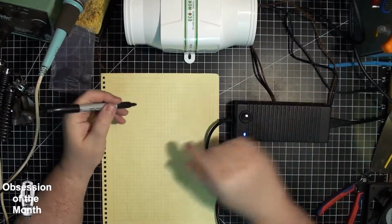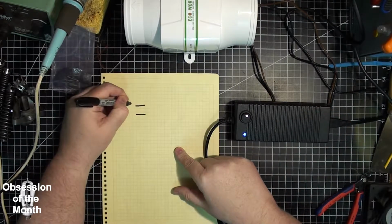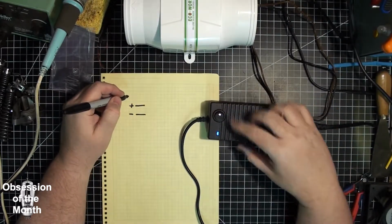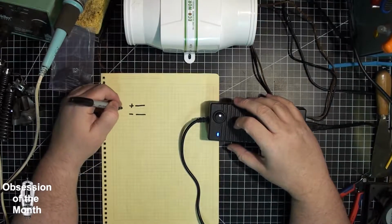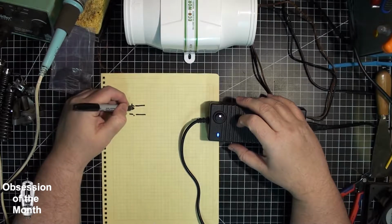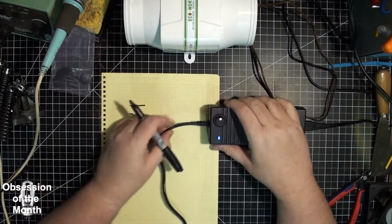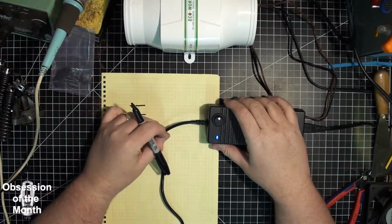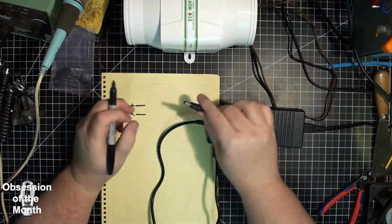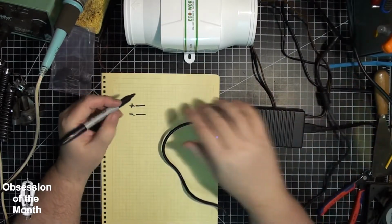So what we got here is I took the power coming off the DC, and also if you notice, you can see the LED. I stuck the LED right here where the power comes off with its resistor, pointed it straight up at this, and it's fine. I couldn't replace this cord. I did not have anything heavier than 18 gauge. I could make one, but putting the ends on and having them work right and not short is kind of difficult, so I just left this.